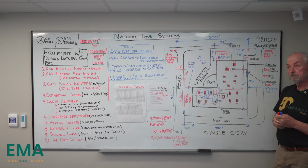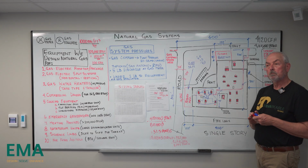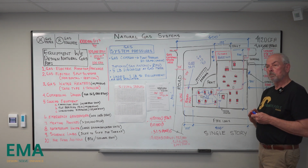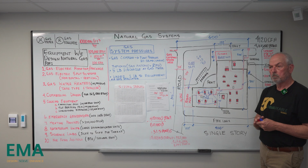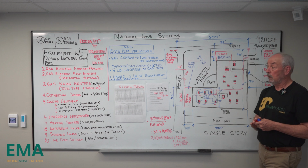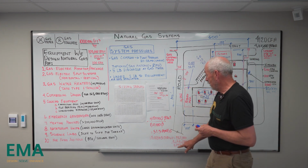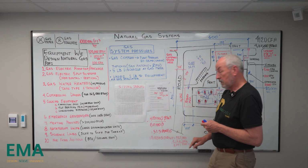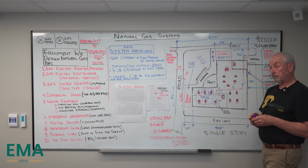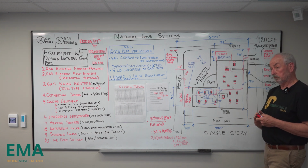What would happen in an instance where the future addition calls for you to size up larger, but what you have existing is sized down? In our example, with the future additions, we got almost to that next level where we needed to size up. Okay, so we're at 5 million and the 3-inch can only handle 6 million. So when there's a disparity, and what you have existing calls for a 3-inch, but the future additions may call for a 4-inch.